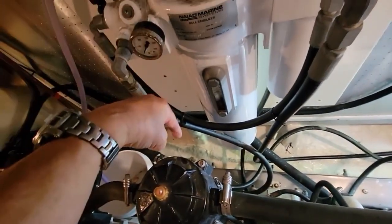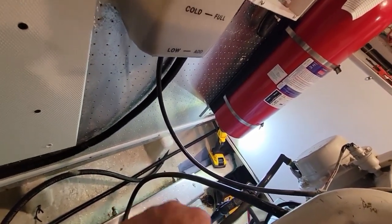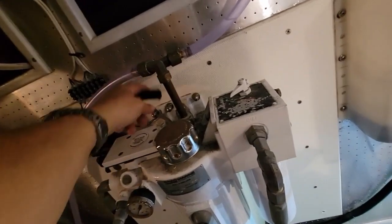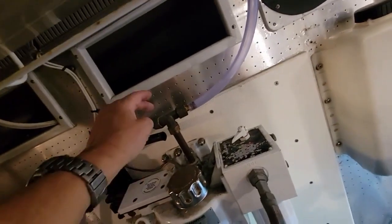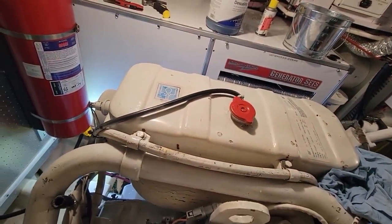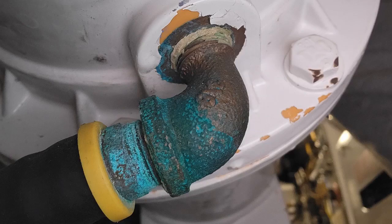The components are: the cooler, the pump integrated in the engine — both, actually — and then the two lines that run forward to the fins underneath the galley forward. This is the cooling circuit. You have cooling water going in and cooling water coming out. The cooling out circuit, this black hose here, integrates into the exhaust system. The supply side is a black hose as well, and it goes to the heat exchanger on the Caterpillar engine. As the engine's running, it's pushing the salt water through the raw water system, and part of it comes out of the heat exchanger and goes up here.